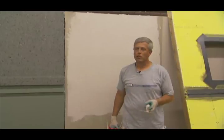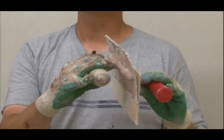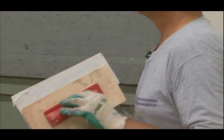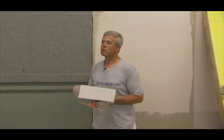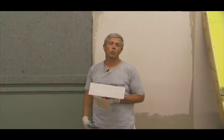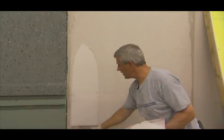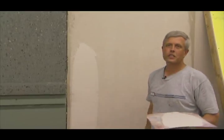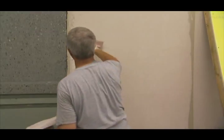When you put the second coat on, you'll notice that I go from this angle to this. It will smooth down just like a white-coated surface. Then you immediately open it up, walk away from it, and if you want to make it perfectly smooth, slide a trowel right across it one time and walk away. With the second coat, you'll notice when I trowel it — can you see how smooth it lays down? It's like it grabs it, just because it's got a little bit of suction to it.